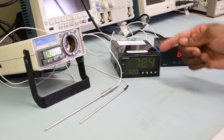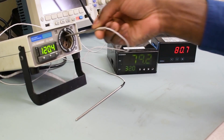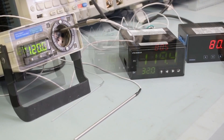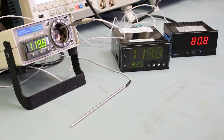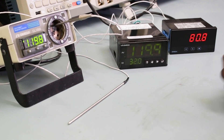First up is our platinum series meter with our PR11 probe. I'm going to take the PR11 probe and insert it into the CL1000 calibrator. As you can see, the platinum series meter number is going up and our temperatures should match. The platinum series has stabilized and it's matching what's reading on the CL1000. So we know that this meter is calibrated and it's ready to be used.